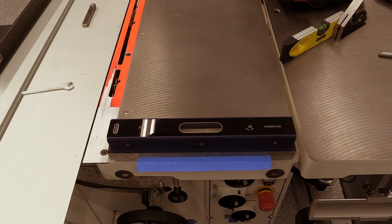Now that we have a general level accomplished on the machine, the next step is to finally level the cast iron top making sure there's no twist in it. For that process we're going to use a machinist level, a lot of patience, and some more shims.